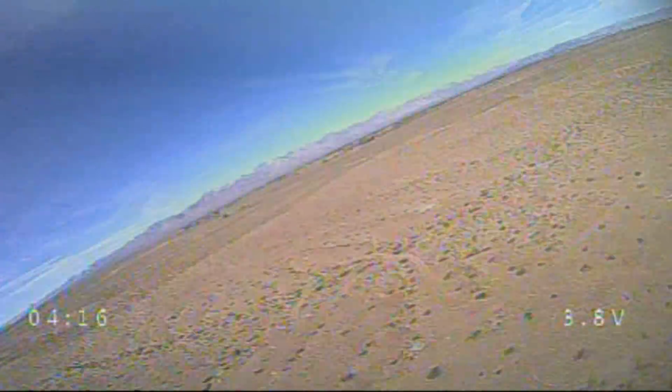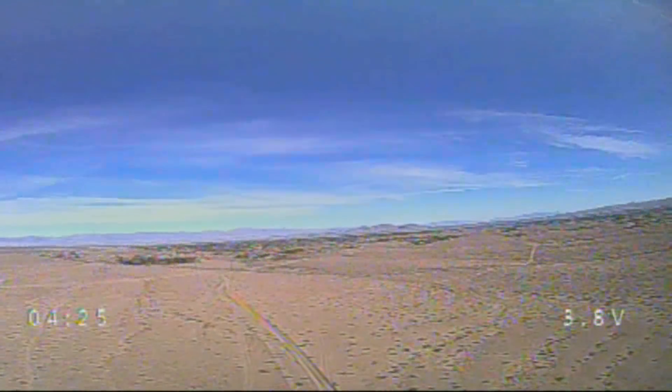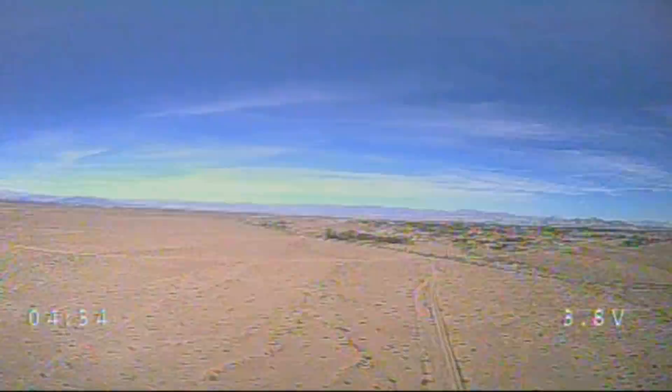So we've got a lot of flight left. I took that battery down to 3.5 volts and it was no problem at all. They tell you it's 5 volts minimum, but I don't think that's true at all, because I'm using a LiPo battery with it and there's no problem powering this thing. Let's go out to the edge of its range. I want to go to the left because I know this area a little bit better. I'm losing a little reception, but that was because the antenna was probably pointing directly at me. Over here I'm guessing about 100 meters away.